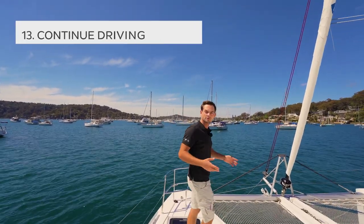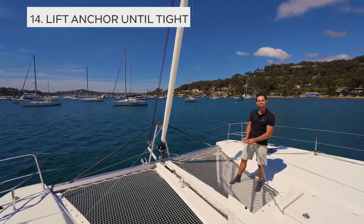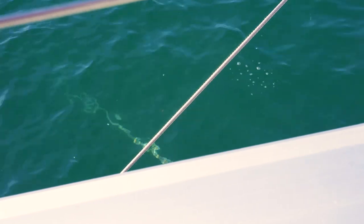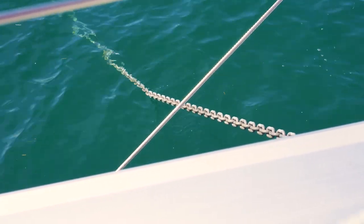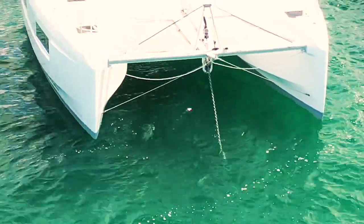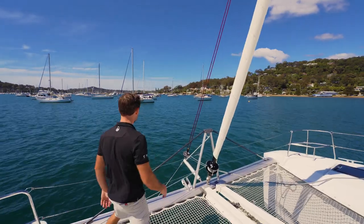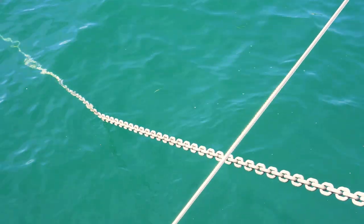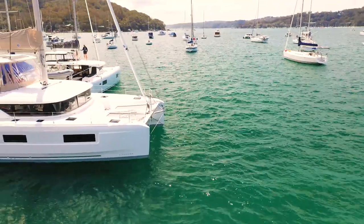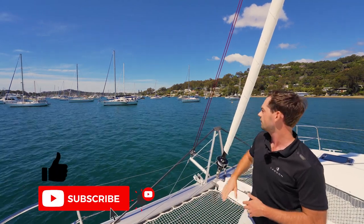Driving on the lines, the boat is now secure. I'll lift the anchor up. I can feel the anchor chain going quite tight — looking out the front there's maybe a 50-degree angle on it. I'll keep tightening and as the chain straightens out along the seabed it will go slack periodically; I keep going until I hear the chain loading up. Looking at the bow you can see a nice 45-degree angle on the chain — the weight of the chain not on the seabed is pulling the boat forwards effectively. I'm now confident to turn off the engines, knowing the anchor is out just forward of the boat.